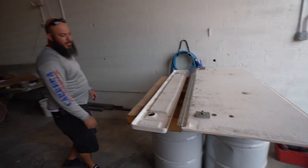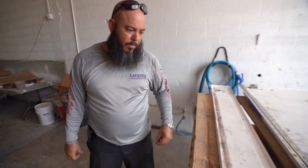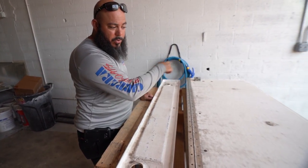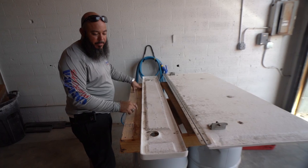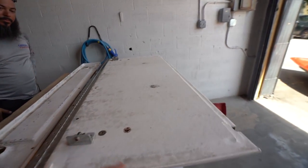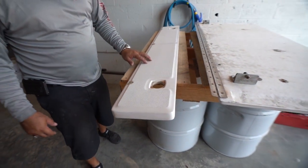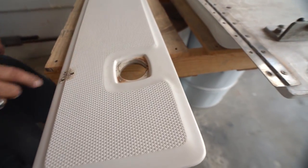This is the lid that the 28 Angler has donated so you can make the mold. Can you briefly explain the procedure to make the mold of this? We're going to close all the holes and get everything finished. They'll paint everything out, then do a reverse flange on it, then pop out the skin, and then we can do the mold from there. If we turn this over — you also have to duplicate the floor texture as well. This is going to pop out with the mold — it'll have the non-skid. These holes will all be sealed on the mold — everything closed.